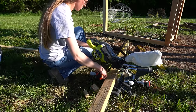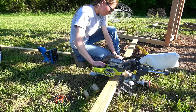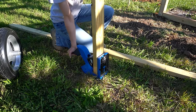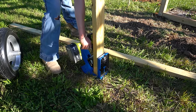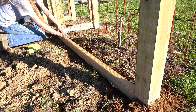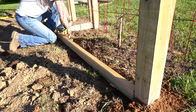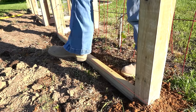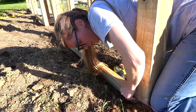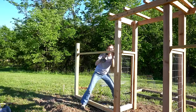Although I measured these roughly 5 foot from the arbors, there's no way to get posts set perfectly at that distance — at least not for me. So once they were set, I cut to fit 2x4s between them and the arbors. I installed these along the bottom using pocket holes and exterior pocket hole screws. The ground here wasn't perfectly level and it really didn't need to be, but I did want to make sure the pieces stayed straight and didn't look wavy. So I used a string to keep the boards straight across the top, then cut and installed the top 2x4s so they were all at the same height.